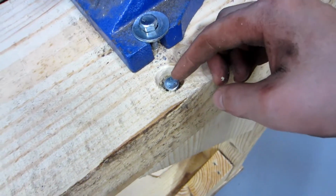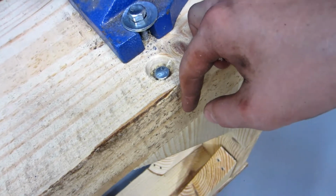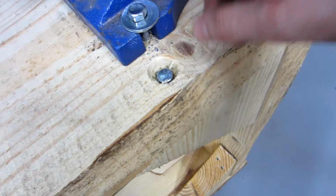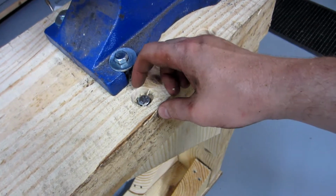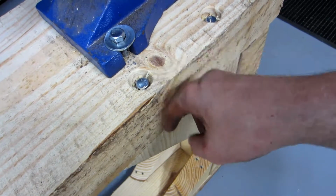And then if you're using an impact driver or something else like that, only put in the thread portions if you're going to do a number of them all at the same time. That way you're not stressing it out. The thing that humans are worst at is the repetitive motion of cranking these in. And the thing that the impact driver is worst at is getting the shaft down after you've already gone through the threaded portion, which is smaller diameter.